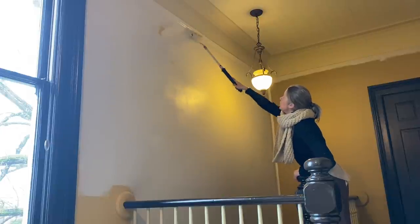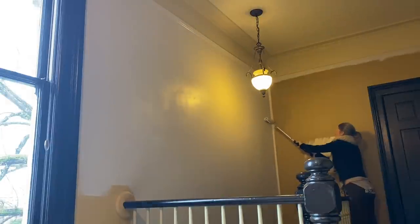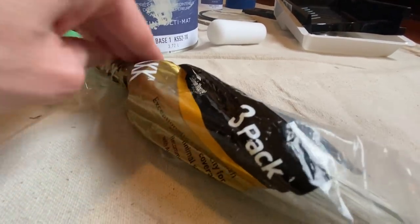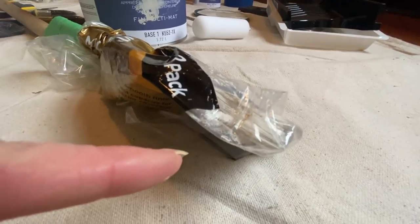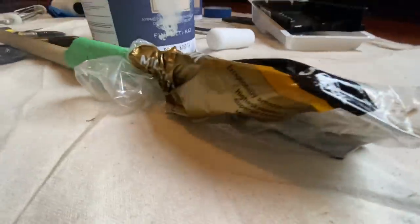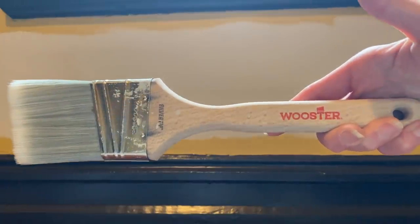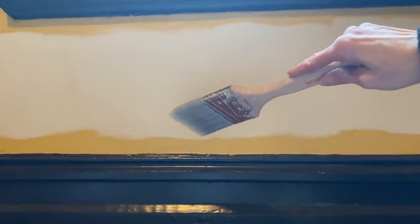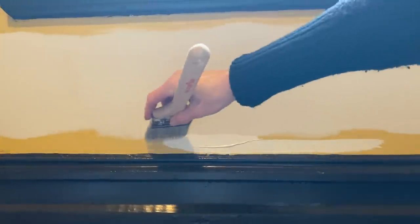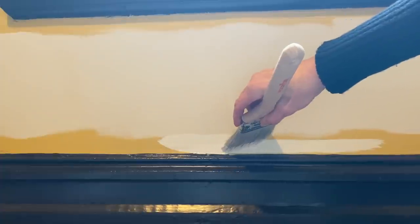The reason I'm doing it in this format is I don't really want to paint the ceiling and I didn't know how much of the crown molding I was going to paint, so I went with what color I was starting with and worked my way up. Always wrap your paintbrushes even if you're taking a 20-minute break when working with wall paints — it dries and makes your bristles really hard, so be careful and make sure you wrap them if you're not going to be using them for a moment.